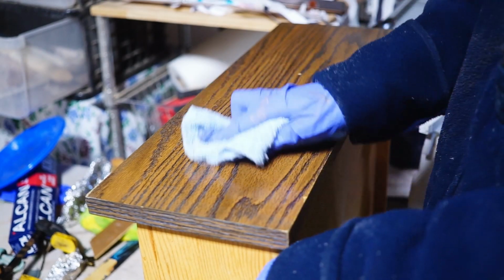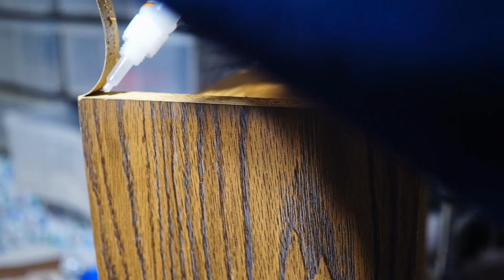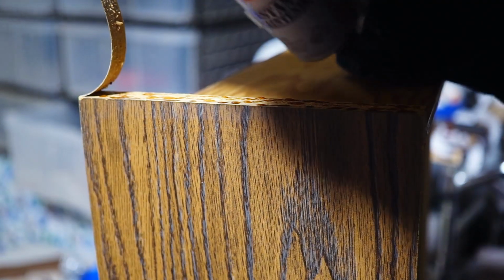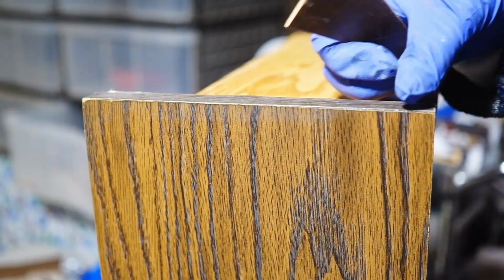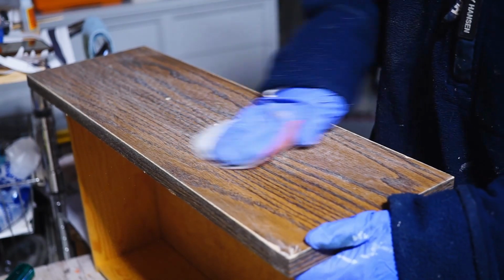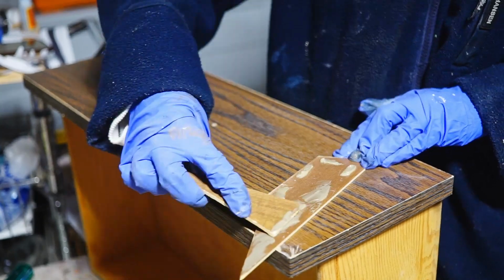The blinds were cut and ready to be glued, but before gluing, I cleaned the dresser with some TSP degreaser. While I was washing the drawers, I found out that the edge painting here and there came off. To speed up the process, I used CA glue with an activator. And then I scuffed the surface with 220 grit. It wasn't necessary, but I did it just in case. To glue my wooden pieces to the top, I used this construction glue I found in my local hardware store.